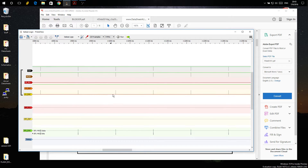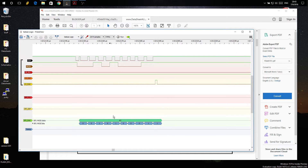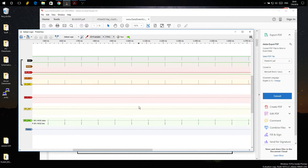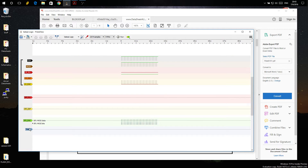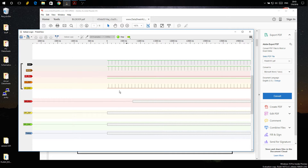The bus has a fair bit of chatter from this DAC. It's just 10 bits, nothing fancy. The decoder shows 10 bits — the same 10 bits unless you change the brightness or something. It's just pulsed over and over again. The DAC is the uninteresting stuff; I have it here so we can see when it fires and know what to ignore when looking at the PLL and expander.